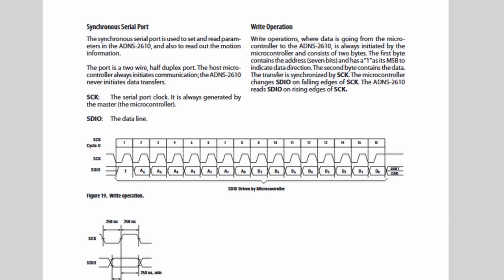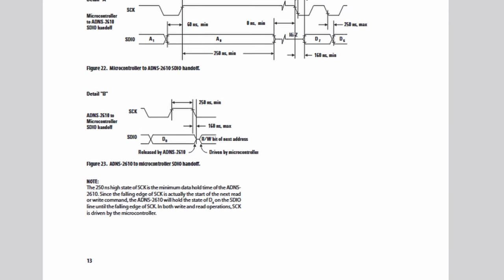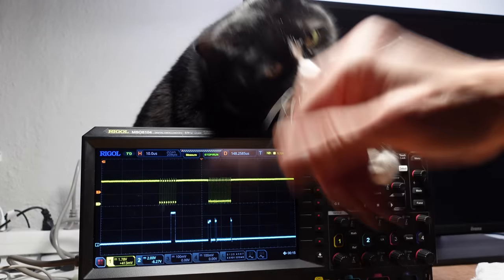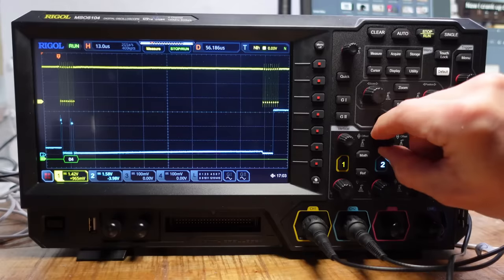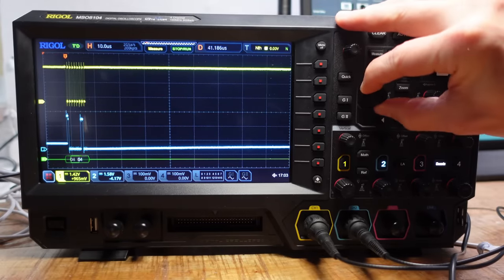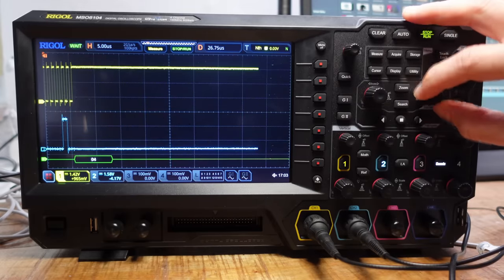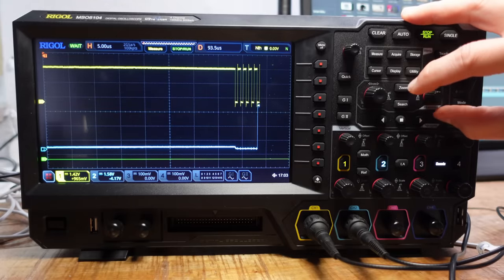Back to the sensor now. The sensor uses a synchronous serial protocol with separate clock and data signals for communication. I wanted to show it to you on my new scope, but my cat was guarding it well, and finally I surrendered. But now I can go ahead. The yellow wave is the clock and the blue one below is the data signal. To read, I first send it the address to read from — it's register number 4. Cranking up the position until we get to the response, around a hundred microseconds later we are getting to the value.